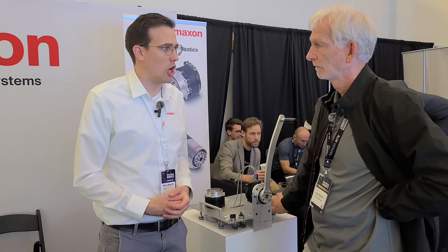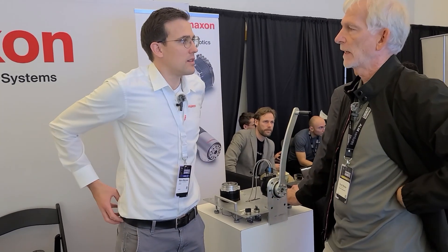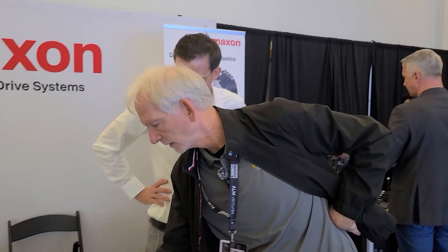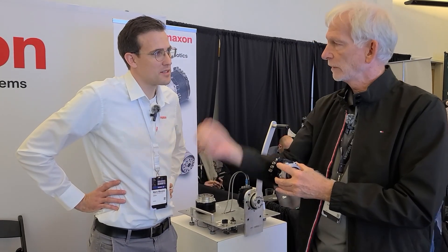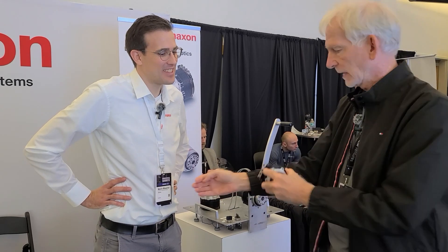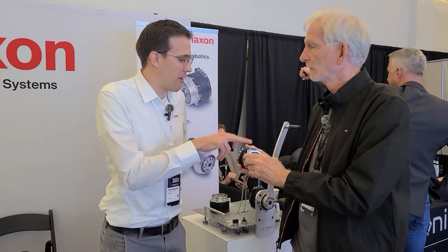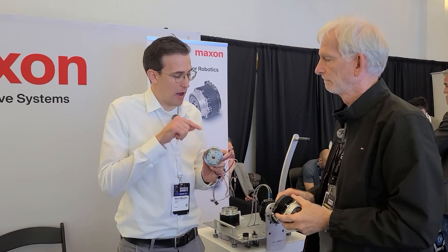I'm considering using harmonic drives in my actuator — are you going to talk me out of it? Depends on your application. Are you conscious about cost? Did you check the bearing system on the wave generator side — are you sure the axial, radial, and bending loads are being taken care of? If this is my knee or elbow joint producing torque, think about tennis elbow from lateral strikes. The strain wave gear tries to always push the wave generator out of the cup — not a lot of people notice this — which puts a lot of load on that bearing. If your bearing structure isn't dimensioned properly because you want to be lightweight, it's going to cause bearing wear and noise over time.